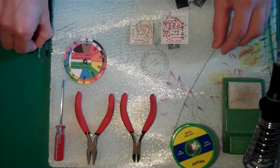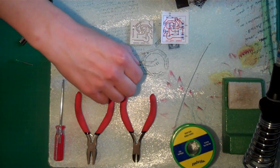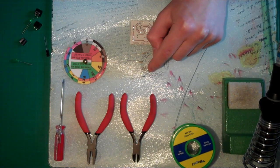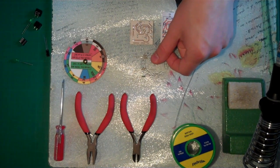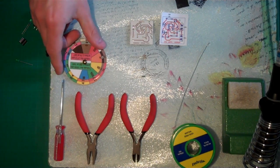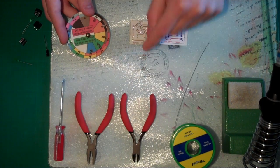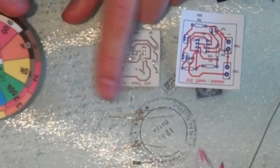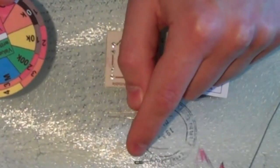We've got four resistors which are the lowest profile components. The green coloured one is a metal film resistor and the beige coloured ones are carbon film, but for the purpose of this circuit this doesn't matter. Straight away we can see that we've got two resistors that are the same, so we can pretty much assume that's R3 and R2, but let's not make any assumptions and just check just in case. We place them with the gold band on the right hand side — this will be on the left hand side for you viewers — so we have the tolerance band.